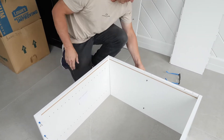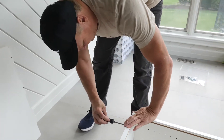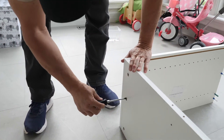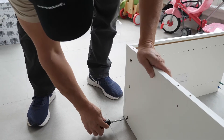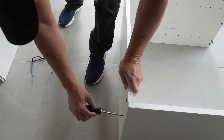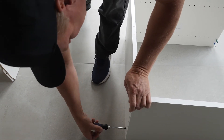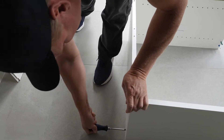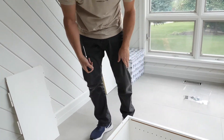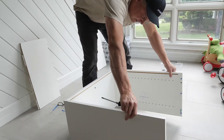Come around the back — this is where you'll tighten it up. Tighten all six cams. How far do you turn them? It's about a three-quarter turn. You'll feel it tighten up to where you can't turn anymore, and that's when you know you're snug. You'll notice all the channels are matching up — this is the back side, and this will be the front side where you have the finished edge band.